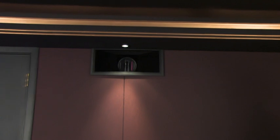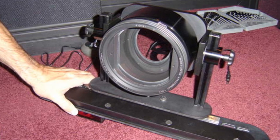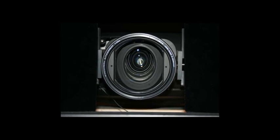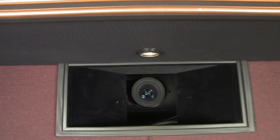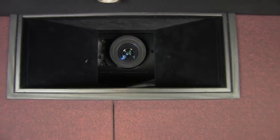Now the projector is behind the room in a separate projection room, firing through the port that you see there. In front of the primary lens is an ISCO 3 anamorphic lens, which allows you to stretch the image on the 16x9 chip and utilize the entire chip — so there's no zooming or loss of pixels. The ISCO 3 is certainly one of the best anamorphic lenses available, and it's on a motorized sled. When I hit the remote for a 2.35 or scope aspect ratio, the projector stretches the image to fill the chip, and then the anamorphic lens restretches the image out to the screen.